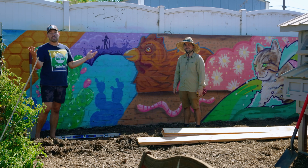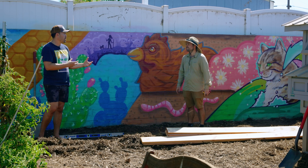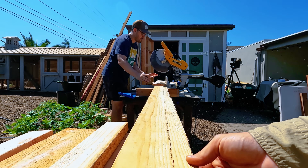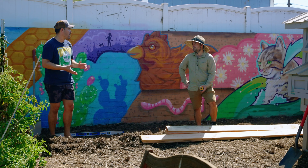We don't want to butt it up against the wall, have moisture pockets, and rot out the wood — especially since we chose Douglas fir, which is good but not incredible wood, so it's a little more prone to rotting out.